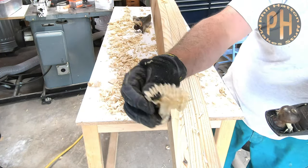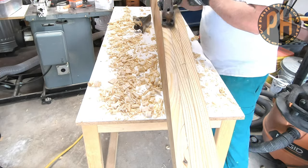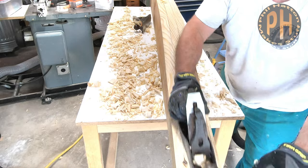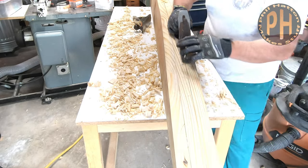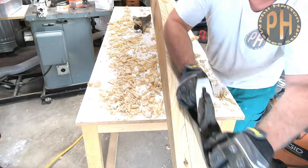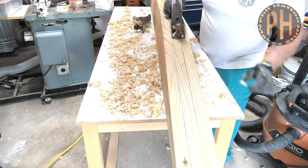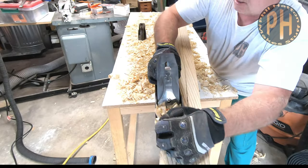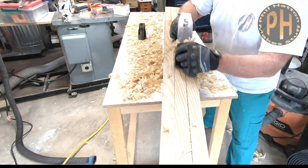It would be strong enough with 2x8 joists running longitudinally, but I used three 2x10s, screwed them together to take out some of the warp, and cut either end off at an angle in an approximation of the curve I wanted. That way I could have them all match. I don't have a bandsaw at the moment, so my cuts were straight lines, and I used my wide smoothing plane to round over those angles.